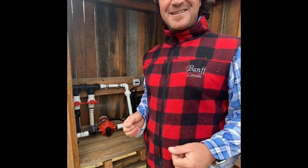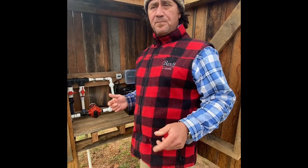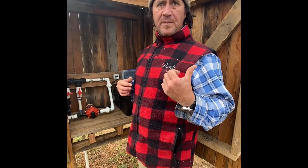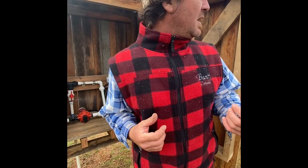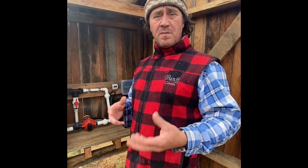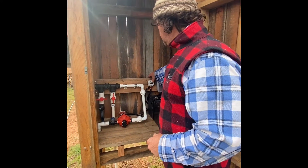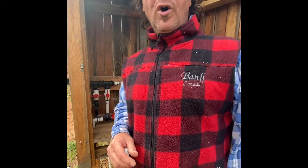Let's turn it on and see how we go. This morning's experiment is to see how much volume of water we've got coming out at each section. We've got close to about 200 metres uphill at around about 10 to 15 metres elevation. I want to see the volume and time — that's what we're going to be looking at most. I'll turn it on and go for a walk.